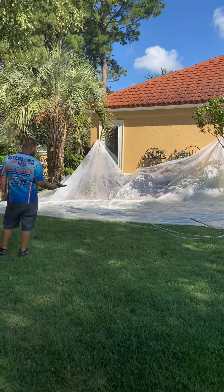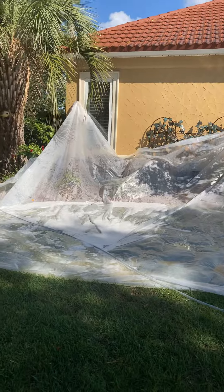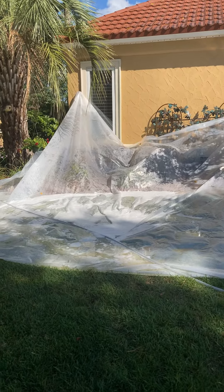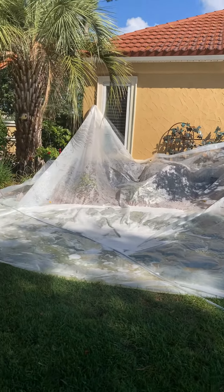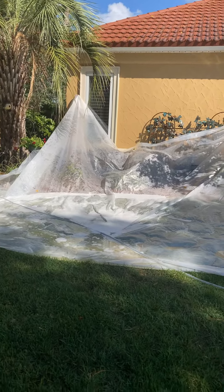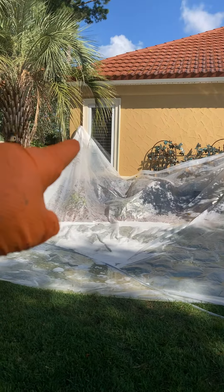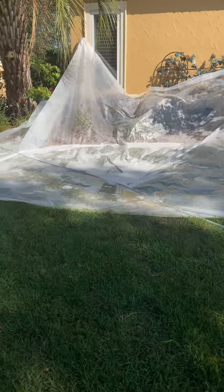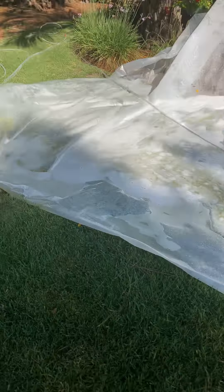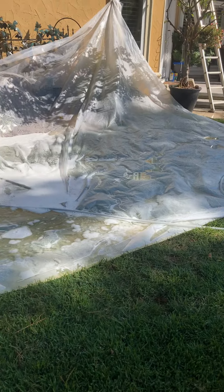When you're doing a job like this, you see my plastic? What I've basically built is a pool. When you have a shingle job, a tile job, or a metal roof job and you have no gutters at all, and we have significant plants and shrubs around this home — very expensive ones — basically what we do is take a couple of boards, stand them up against the house, wet all the vegetation under the tarp, and then build a pool of water. As the chemical comes off that roof, it puddles into this pool, and as it drips out over into the grass, it's diluted to the point that it's not going to kill the grass or the shrubs.